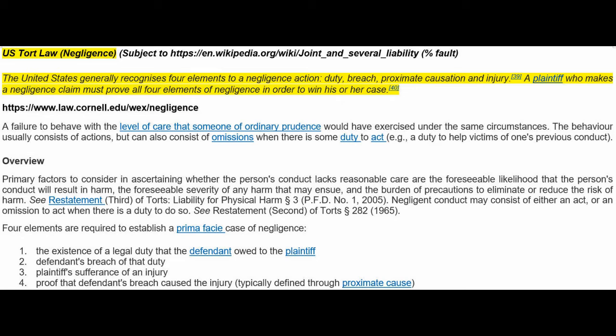If it is, and it can be proven that they know that the heat inside of that duct would be in excess of what's covered under the conditions of acceptance for ASTM E119 and UL 263 CAN ULCS 101, that would be exceeded, meaning a clear and present danger for life safety in the building, being that the purpose of the pressurization ductwork is to enable people to breathe as they egress or hunker down until rescued, right?